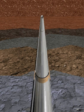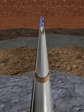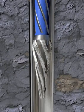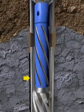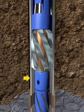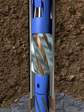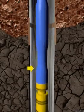Before starting a section milling operation, the wellbore must be clear to allow passage of the BHA. The section milling BHA is then run in the hole to KOP depth. Typical accessories below the lock-o-matic include tapered mill, drill collars, jet sub — which can be run below the tool to clean the cutters or above the tool to enhance wellbore cleaning — and stabilizer. Typical accessories above the lock-o-matic include drill collars, shock sub, and drill pipe to surface.